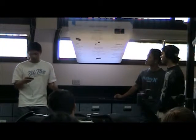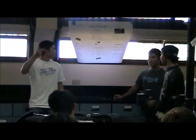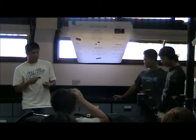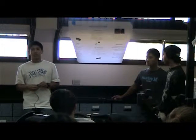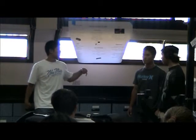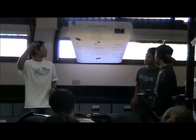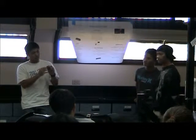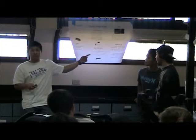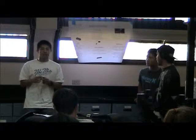There are two different types of pickups. There's the classic single pickup, like right here — you can see this one is kind of half of it. Those were used before and they're not as efficient as humbuckers because they're prone to picking up something called mains hum, which is a frequency generated from outlets. In the US it picks up 60 hertz of voltage induced by a transformer. Humbucker pickups use two coils that are reversely wound, so when the mains hum enters, the reverse winding cancels out that 60 hertz. In turn, the sound output is doubled.